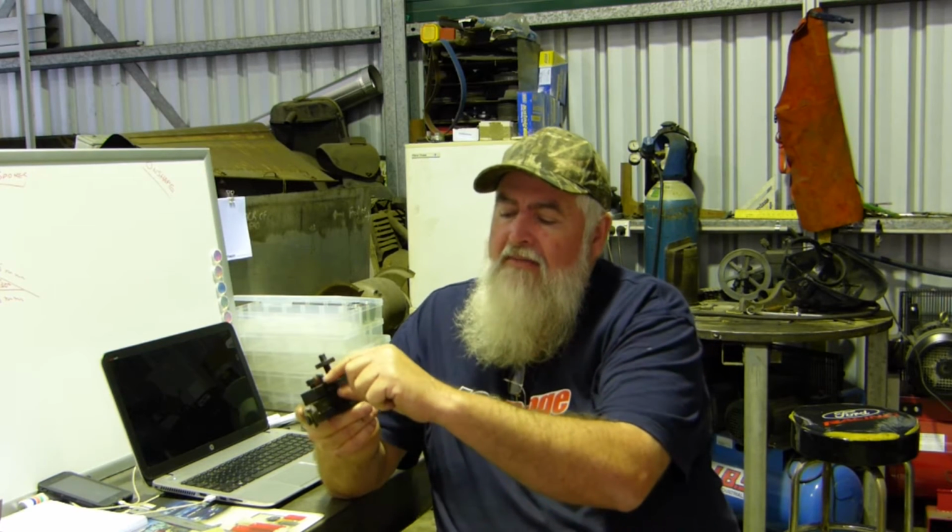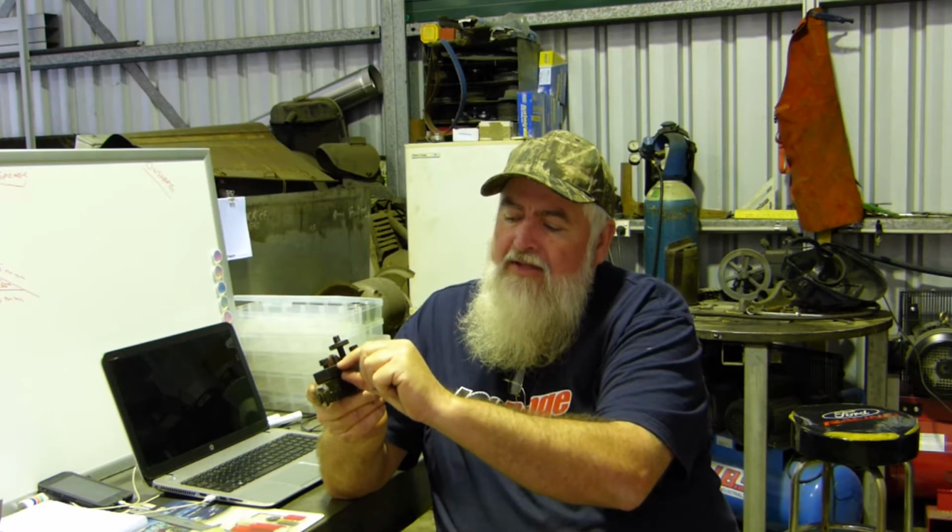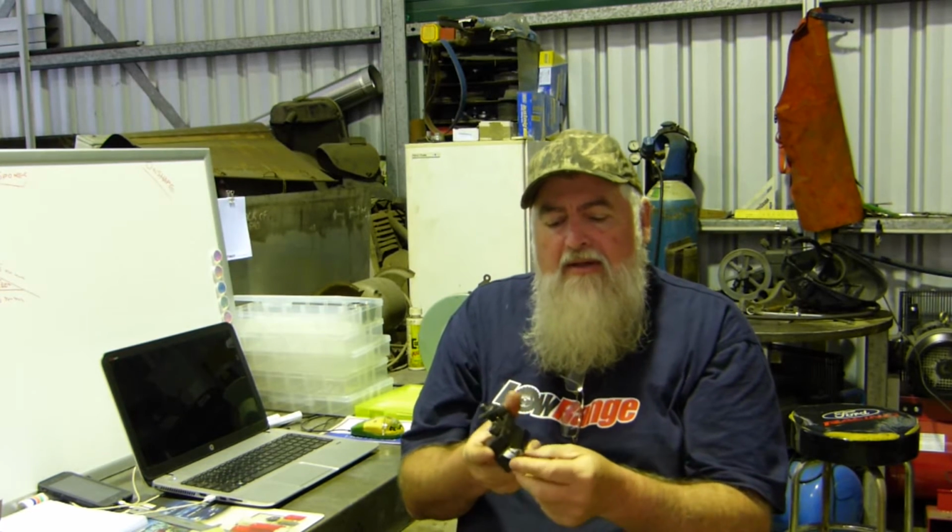They're 8 by 1.25, and all this hang-up here, well, we don't need all that up there, so I've got 16mm ones, which should make them about flush here, but anyway, we'll just see how that goes. But yeah, I'm putting just a piece of 1/4 inch tool steel in there, and there's a little jig they give you with it for sharpening them, and these cut great if you don't flog them like that.